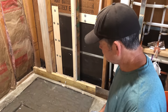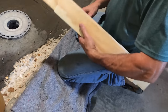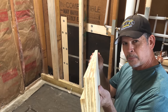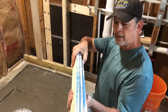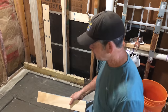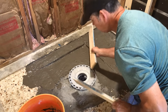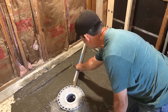I used to have a set of aluminum screeds but I don't anymore, so I just use my track saw — these are perfectly straight. This is the track saw edge. I painted the other side blue just so I wouldn't get confused, and we're going to use these for our screeds. The short one will be from here to here, the middle one will get me almost to the corner, and of course the long one gets me from the flange to the far corners.